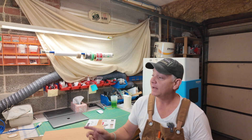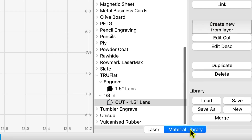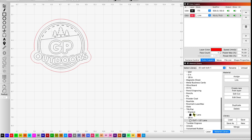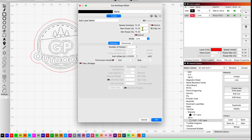So I'm going to get you my settings first, and then we're going to just try to do a simple engrave and a cut on the True Flat and check on a few things. Here in Lightburn, we're going to jump down to my material library. I've got my True Flat settings set in there already. My engrave setting is 500 millimeters per second, 50 and 50 percent power, no air, fill mode at 400 lines per inch, one pass. My cut settings: 10 millimeters per second, 75 and 75 percent power, high air, one pass, line mode.